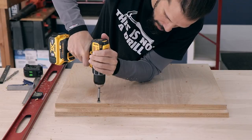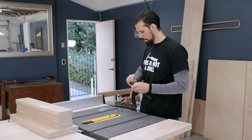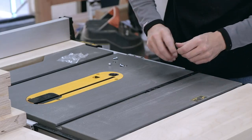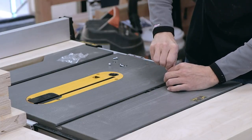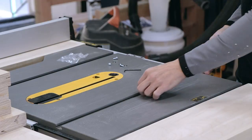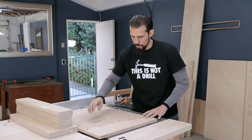These slider bars have screws going through the top, so I'm using a Forstner bit to sink them beneath the surface. I'm putting the first one on with the screws going through the pre-made slots underneath. The second slider is completely adjustable for whatever width your miter slots are — just tighten the screws for a good fit with no play. For now I'm only putting on one slider, toying with the idea of leaving just one so it can be used on both slots for angled cuts on the edge of the sled without messing up the opening, keeping it as zero clearance on the main portion. I may just add the second slider later.